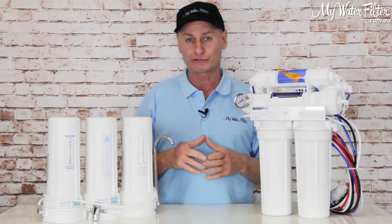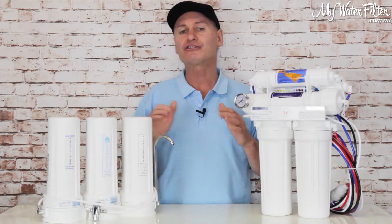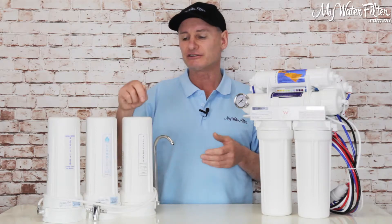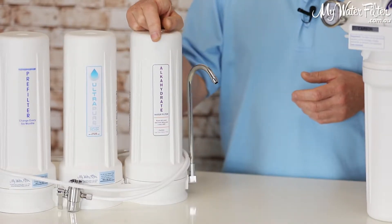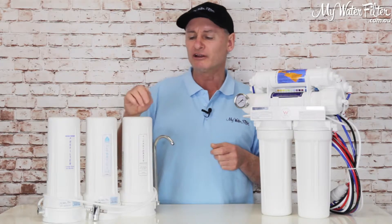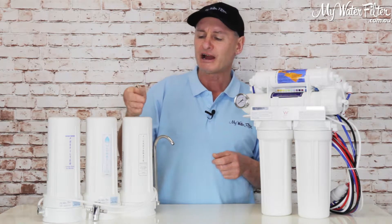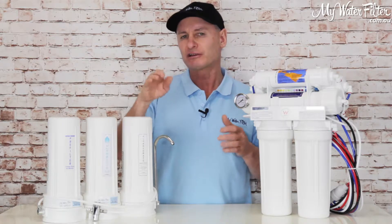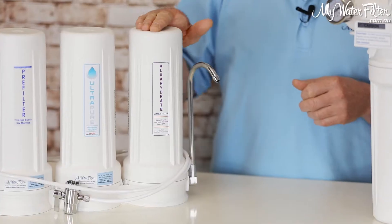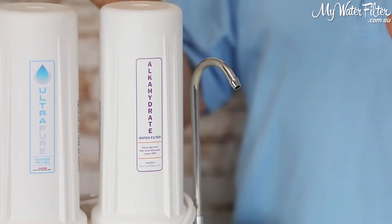There are a couple of different ways you can go for that third cartridge. We have a pH neutralizer — basically calcium in the water — neutralizing and elevating the pH just up to seven, so people are drinking neutral water. And then there's this filter here, which has got an Alkohydrate cartridge in it — a 10-inch drop-in cartridge full of different minerals. This is more likely to elevate the pH up to 9 when new, slowly coming back down to 8 or 8.5, fading away over time. These will give you a much higher pH level than a pH neutralizer — so there's two styles there.